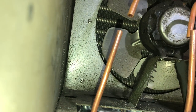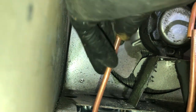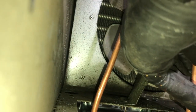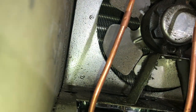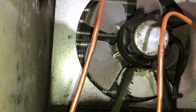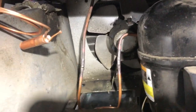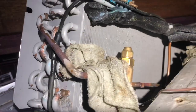I'm going to show you guys the fastest swedge - fastest swedging tool ever made, and it works really well. That's the fastest swedging tool right there - the old copper couplings. I learned that from a guy named Frank Rizzo, he worked upstate. On the TXV, you want to put it in upside down so if you have to make an adjustment you can get to the stem. If you put it with the power head on top, good luck making an adjustment on that TXV. So you want to install it like that.